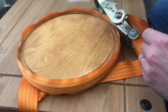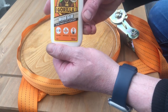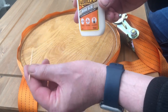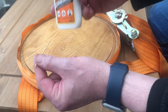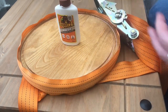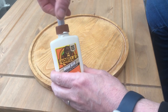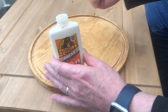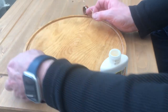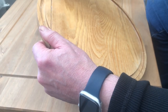I've got some wood glue — I'm using Gorilla wood glue. It does say on it 'for the toughest jobs on planet earth,' so hopefully that's not too far off the mark and it will work. I've got a cocktail stick — the plan is to work it into all the nooks and crannies. I'm going to unscrew the top just to give me direct access, as I don't really fancy messing around with the applicator. Then we'll make a start on the worst part, which is the bit that gave way when I applied the sash cramp. There's plenty of gluing needed in this crack here.